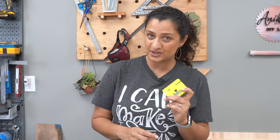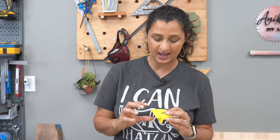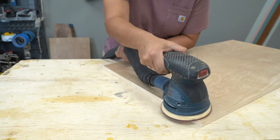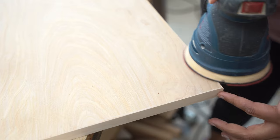One of the challenges with using a trimmer tool is that over time it can build up residue inside on the blade. Over the last few years I have started using a random orbital sander to simply remove the excess edge banding. All you need to do is use 150-grit sandpaper in your random orbital sander and sand away any excess edge banding and glue residue.